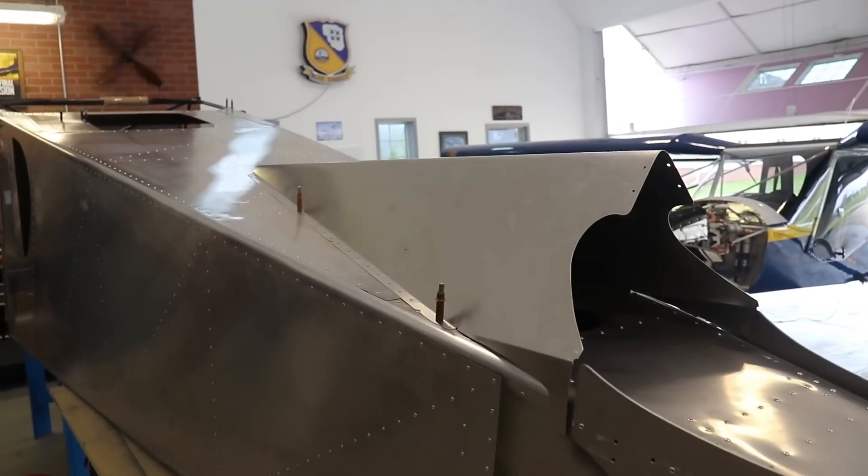And that's what the dorsal fin looks like once it's installed. I hope that little tip helps you. If you've already built your fuselage like I did, you'll see that you'll need to drill out a few rivets. If you haven't built yet, hopefully you see this video before you rivet your fuselage together, so you know which rivets you can leave out and install later when you're installing the dorsal fin. Make sure you like the video, subscribe, and I will see you on the next Super Duty update.